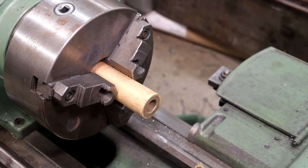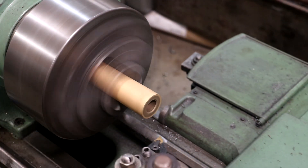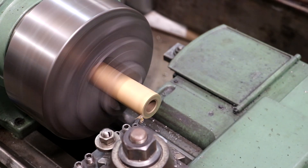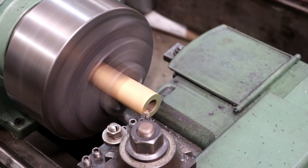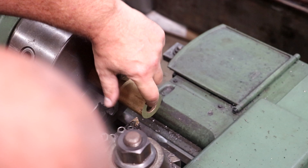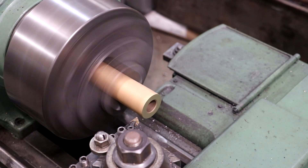Got the parts set up over here in the lathe, just got chucked in there, and we're going to start by facing the front of this, getting a good surface. This oilite will kind of have a little bit of a rough surface because there are some voids in there where the oil resides, so it's not perfectly smooth.